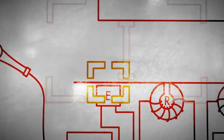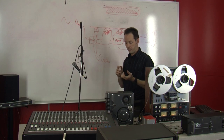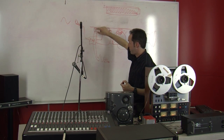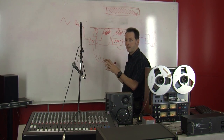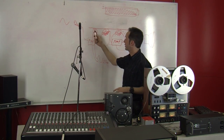And that's just an electromagnet. And what that's doing is randomizing the tape. And it isn't like 60 hertz. It's actually a much higher frequency. But this erases the tape. And this is just a white noise electromagnet, so it's getting, like, static. Works the same way as this if you just fed this white noise static. So that's how that works.